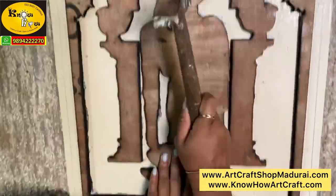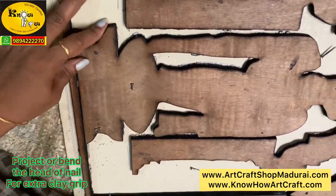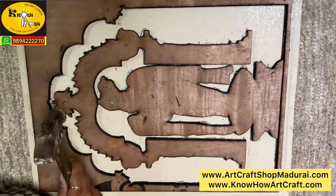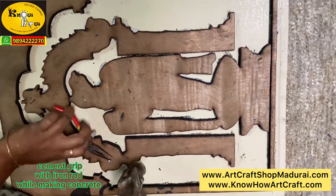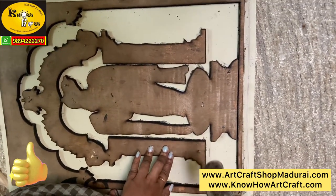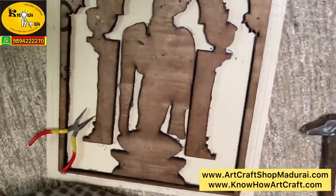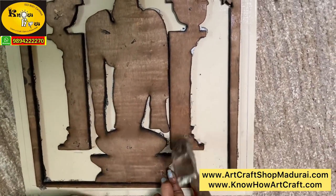This nailing work took around half an hour. An important point: while hammering, the entire nail should not go fully inside the board. It should be hammered such that a small part of the nail head remains in an elevated position. The reason is that after this step, clay will be applied. Clay is quite heavy, and even though Fevicol holds it, these raised nails provide extra grip for the clay, greatly extending the life of the embossed part — it won't fall down or get damaged for 20 to 30 years.